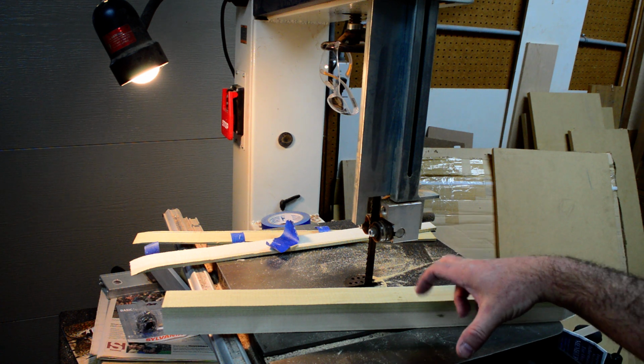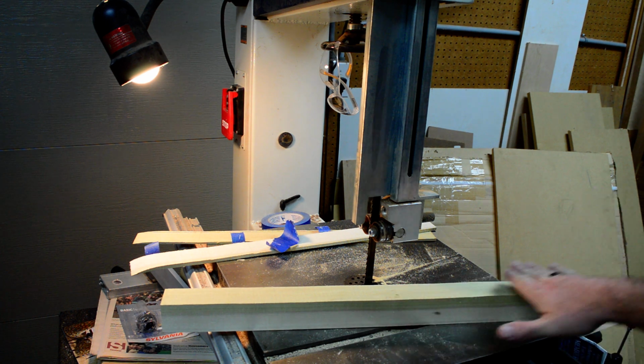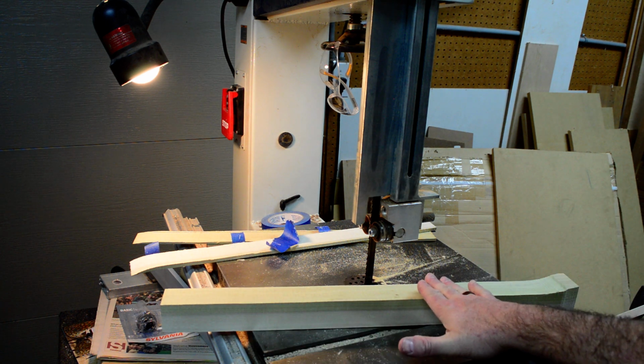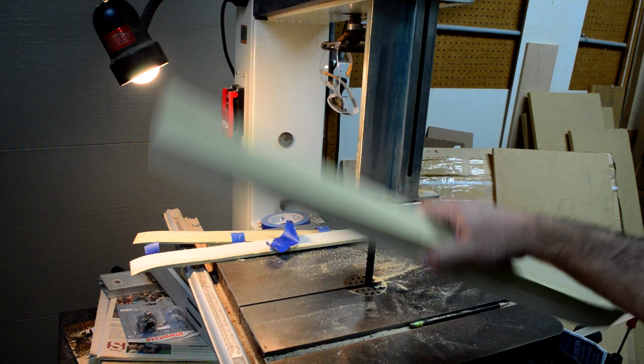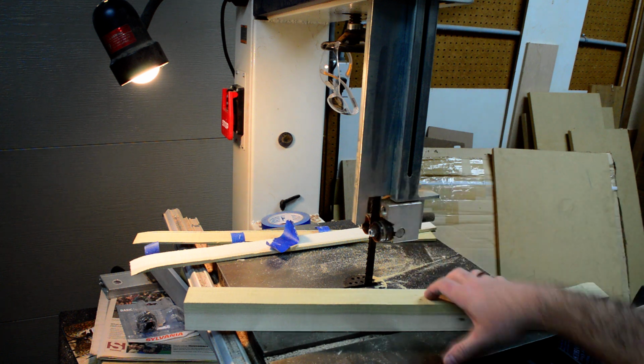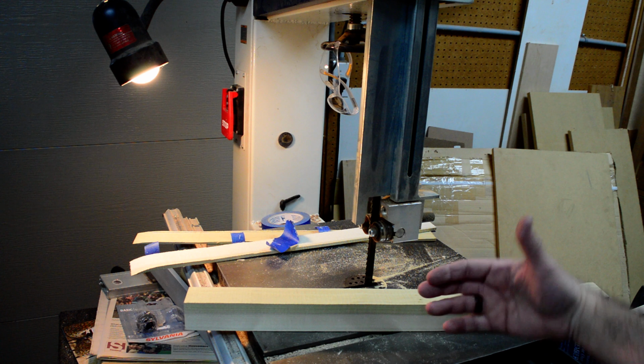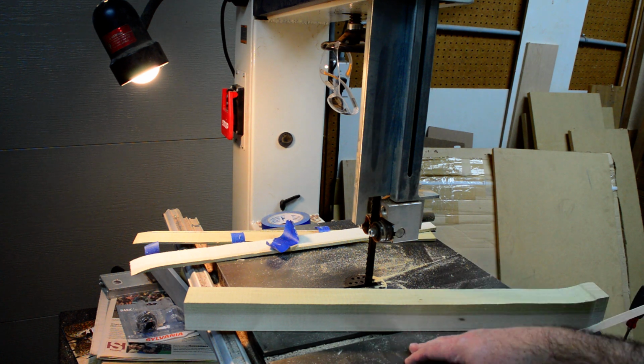But it makes a big difference to have all of those stacked side by side so I can follow along a much broader surface. It's very easy if I'm just sanding this one piece, hand sanding, orbital sander, whatever, to start rolling those corners, which I really don't want to do. So being able to clamp these together as I'm sanding.